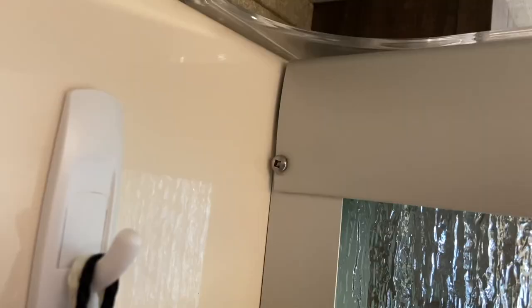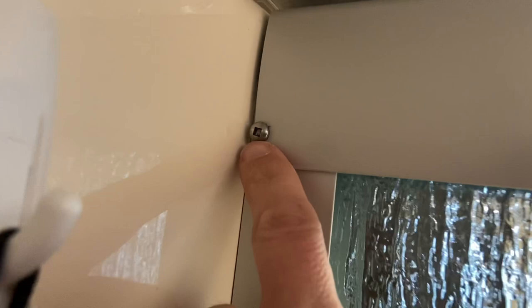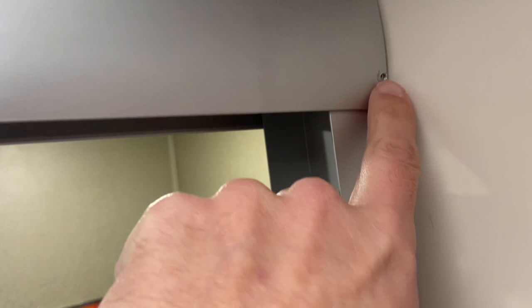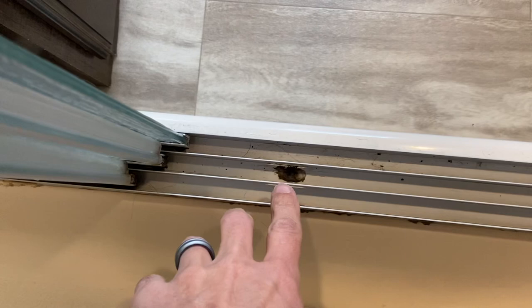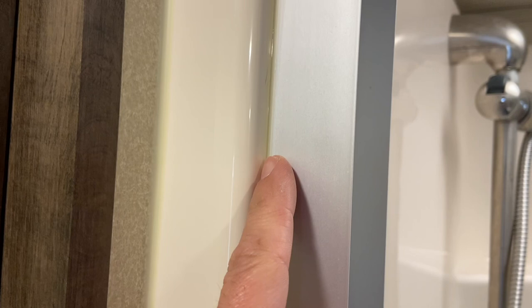It's not too difficult to get the old one out. I'm going to show you the few screws to remove and then you can just pull everything out. You're going to have two screws at the top which may require a square bit — one there, one here. Then you're going to have two or three screws on each side track — these are just Phillips heads, one up top and one down at the bottom. Remove the screw in the track and you should be able to pull it all up.